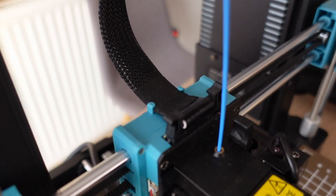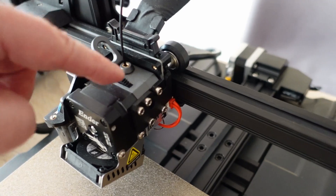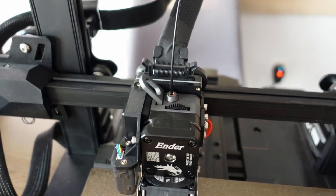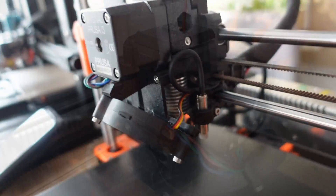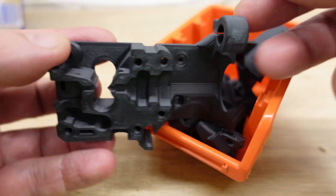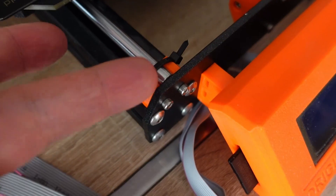About plastic parts: the Sovol uses injection-molded plastic parts even for the head holder, which I'm not too happy about, plus a metallic plate to which the extruder is attached. The Prusa uses 3D-printed parts which by default are PETG — they work fine but I noticed some problems especially with the extruder parts deforming inside an enclosure. I reprinted those from PC-blend carbon fiber, and the fan shroud is from ASA because it's very close to the hotend.